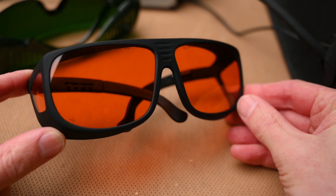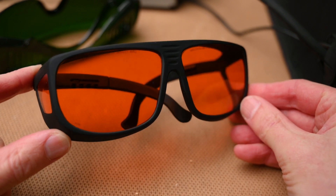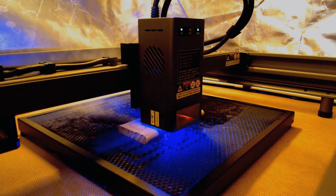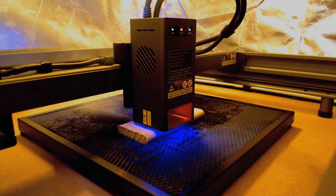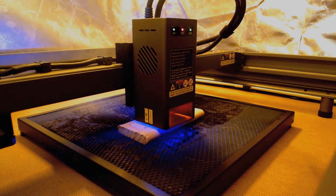So don't take any risk with your eyes, and always check and wear the correct laser safety glasses when using a laser machine. As the machine focuses a high powered laser beam to quickly heat and burn away material, there is a risk of fire. The machine does have a flame detection alarm built in, but still keep a fire extinguisher nearby and never leave the machine running unattended.